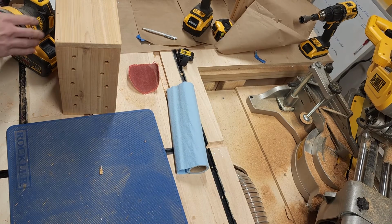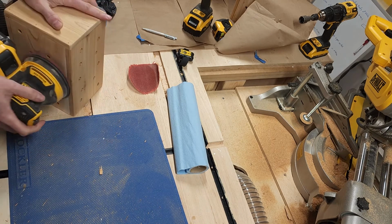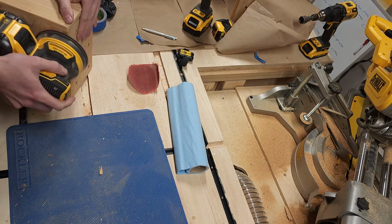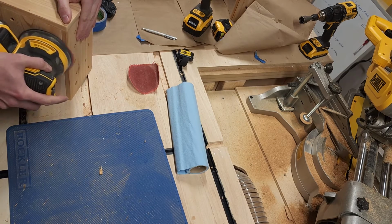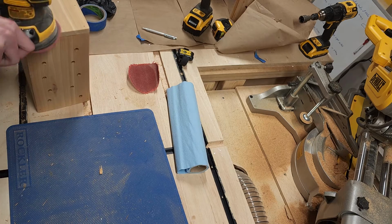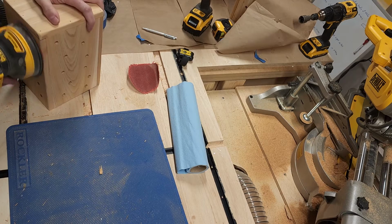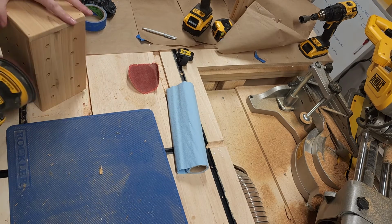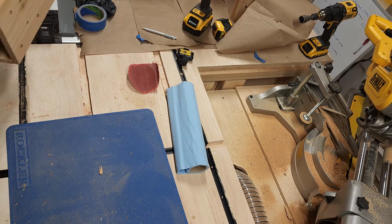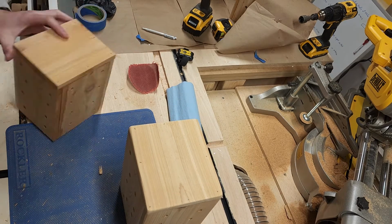And we're almost at the final stretch here. Final thing is basically doing a little bit of sanding to soften the corners and pretty much clean up any of that glue that's still left over. Sand that down. I'm just basically using 80 grit, between 80 grit and 120, to speed up the process, to clean up those angles and the corners, basically just round them over the best you can, and then eliminate any of that glue squeeze out from your glue ups.